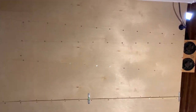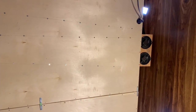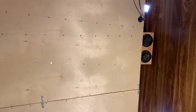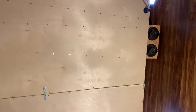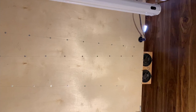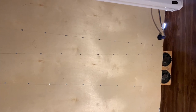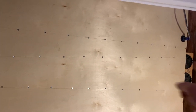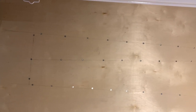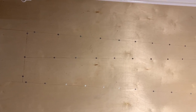Now, what is a tapped horn? Well, a traditional bass horn just uses the sound from one side of the driver, just sort of like I showed you down there with the cheap Chrysler 5x7. But it only uses one side of the driver. Usually it'll have the back of the driver in a sealed box somewhere, and the front will be loaded with a horn just like this. Now, a tapped horn just taps into the horn somewhere near the mouth and uses the other side of the driver to help with the sound.